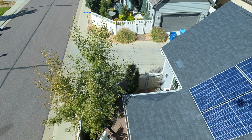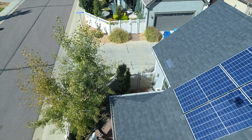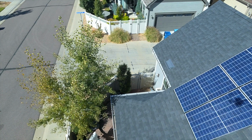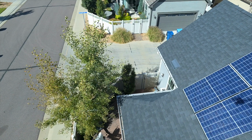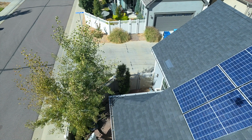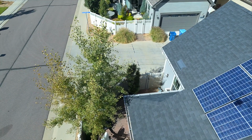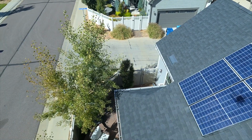Now here you can see we've got a tree in proximity to the roof and the gutters, and that's fine now, but as you know, even now it's a little close to the house. We like to have trees trimmed back 6 feet or so, depending who you talk to. But this one's in contact just about, and it will be eventually. It is potentially a problem causing damage and a place where insects can access the home.